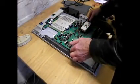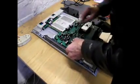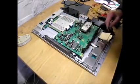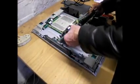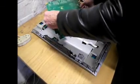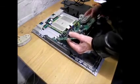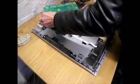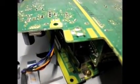Now let's see about lifting this board off. Now let's take this plug out here — there they are. Now we can get at the power supply socket here, which is on here. So there's the supply input socket, which should be 15 volts.